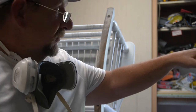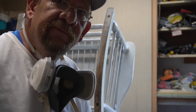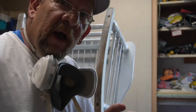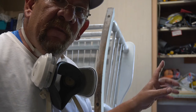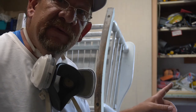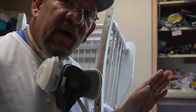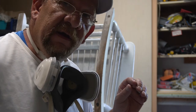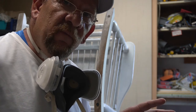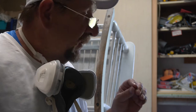Okay, I also noticed over there on number 5, at the top where I started going, I do have runs. This coating, Breakthrough, is very difficult to spray, and it takes a while to learn how to spray it. This coating was actually mixed up for my turbine spray system that I use to get the cabinets as smooth as I possibly can, because it is the Titan Cap Spray 115, it puts out 10.5 psi.